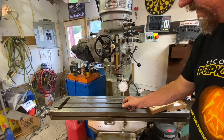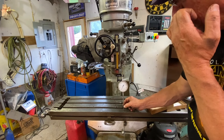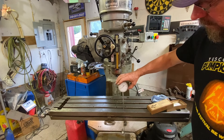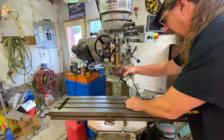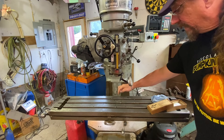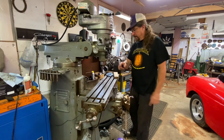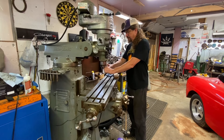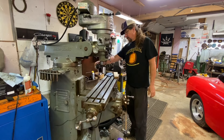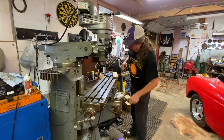This thing is sticking down here at the low end — I don't like that. So we've got to shorten this up so that I'm hitting here and here. Tramming it means you're making it square this way and this way. One of the things you don't want to do is try to do both at once — you will drive yourself forever insane trying to do both of those things at once. The other lever style indicator would definitely be much easier to work with.